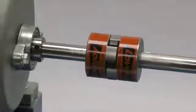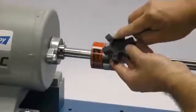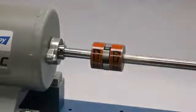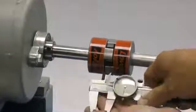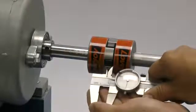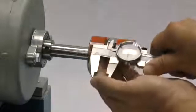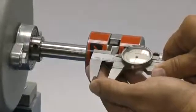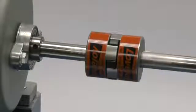Now we will carefully move the equipment into place, bringing the hubs together until they barely touch the raised dots on the sides of the spider. Check the G or gap dimension in the installation guide and measure the separation of the hub faces to ensure the separation matches the G dimension. This dimension should match the installation document to within plus or minus 1/64th of an inch. The set screw on the second hub can be tightened at this time.